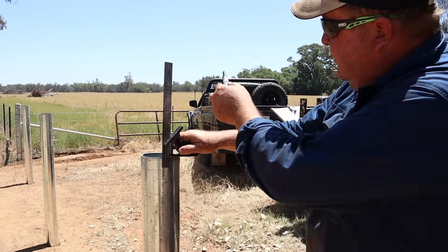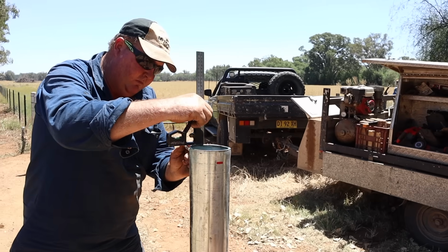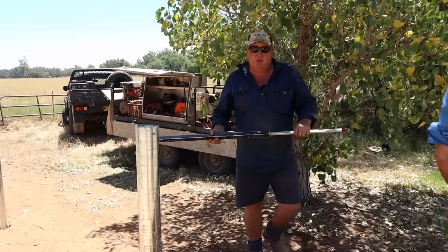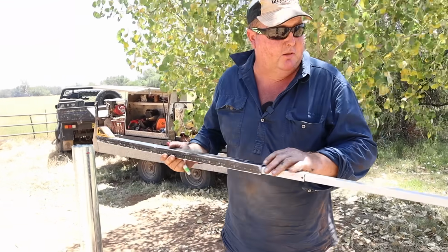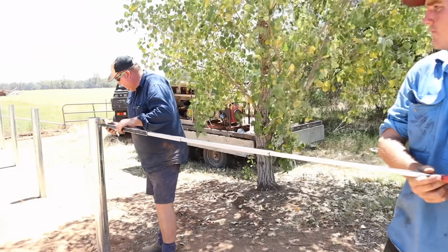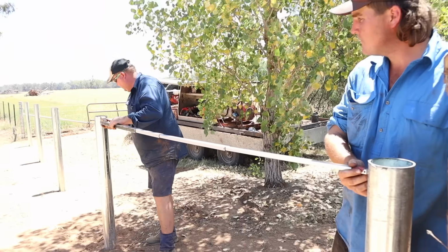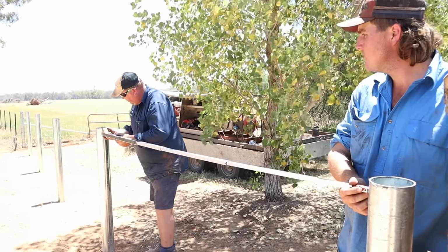This is the line, your line, so we just mark here, 30 mil. Because we want to be accurate to the mil, we're pulling out the telescopic measure stick, and we go center to center, and we have 2599.